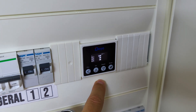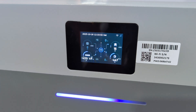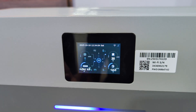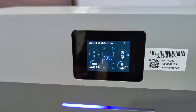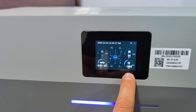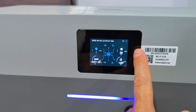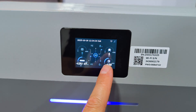It's doing a great job, with all the surplus power going to the battery. We are far from that circuit breaker we just saw, and the job the wireless CT is doing is exactly this: it's measuring the energy being consumed by devices in our house and telling the inverter, 'We are using about 500 watts of the total 900 watts being produced by the other inverter, so let's pick that surplus energy and send it to the battery to use whenever we want.' That's exactly what we are doing, and on this number we can see what is coming from or going to the grid — it's doing its best to keep that value as close to zero as possible.